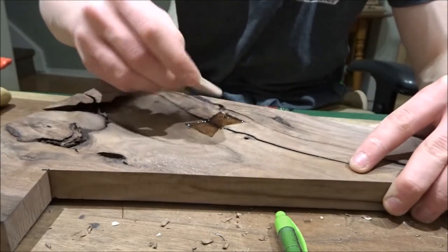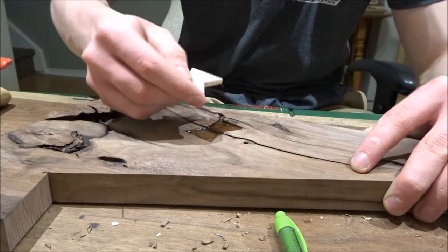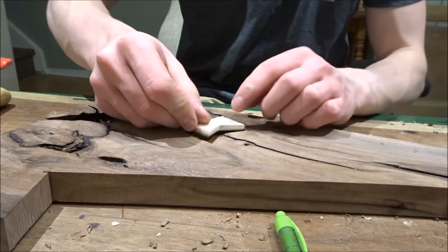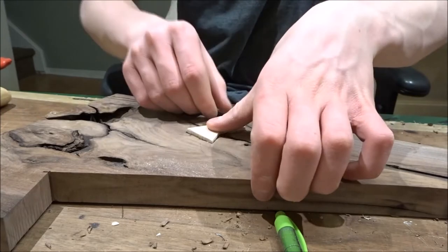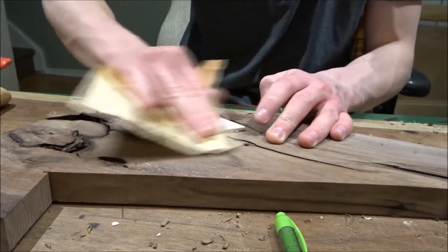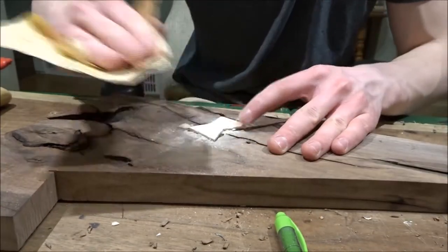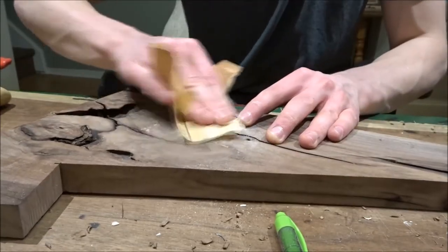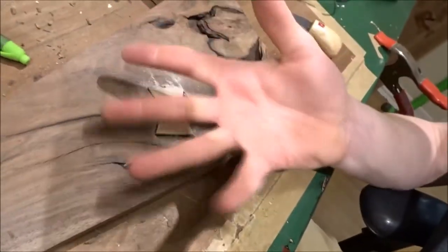Make sure your bow tie is lined up really well, then put it in there and kind of jiggle it around a bit so that the epoxy gets all over the bow tie itself. Once you've got that done, just let it sit for a while and then sand it down. I didn't actually let it sit very long here — I just wanted some of the maple to get into the epoxy, but that didn't really work out. Sometimes it does, sometimes it doesn't — it's a miss sometimes, you know.